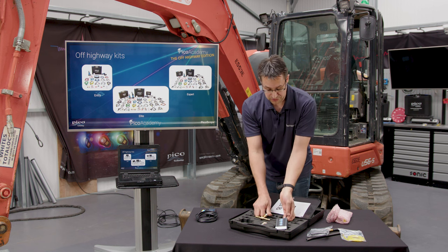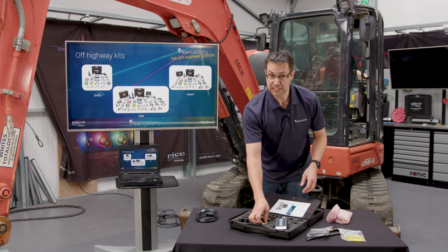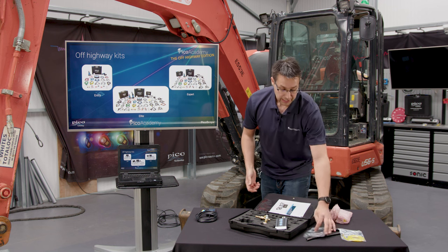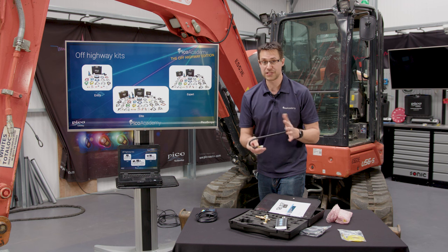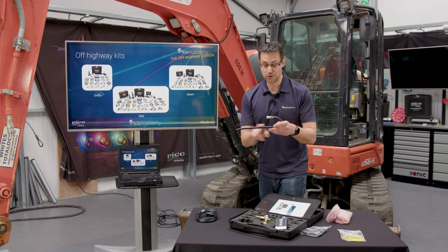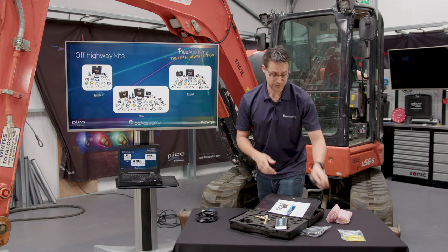Now these allow you to connect in for low pressure fuel work. Again, injector leak off, that's always quite a nice one, to see how each injector is performing and feeding back into the return line. Exhaust, again, is a nice and non-intrusive test. Exhaust pulse is the result of everything: combustion, which is air intake and fuel, and compression. In theory, all of your pulses should be even. If they're not, we need to start looking and evaluating somewhere else.